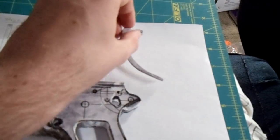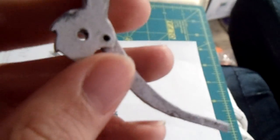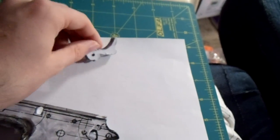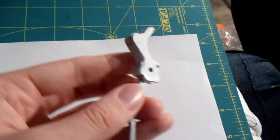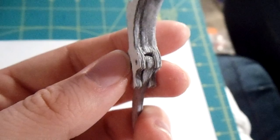Let me just take that out for you — take the pin out and the hammer with the strut. The pin that I have in there, right there, I actually found it — it's a rivet stem that I cut off. It's just a small pin. The strut goes and sits right inside in the middle of the hammer right there, and it just slides right out once you take the pin out.